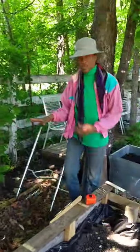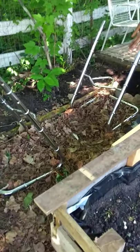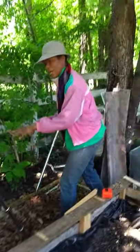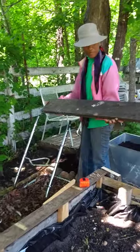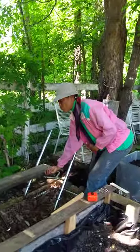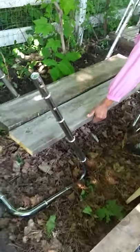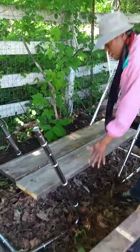I was going to pull what I had going on before so I can show you exactly what I am doing. I'm starting with my base, which are two chair frames. The chairs had seen better days and they were rotty, so now I'm using the frames to make a lounge bench. I have the frames and I'm reusing lumber that was in a workshop. I'm just turning the bad side down and I'll screw from underneath into the wood to keep these pieces in place — that's for the seat. I'll screw those in from underneath and that will be our seat.